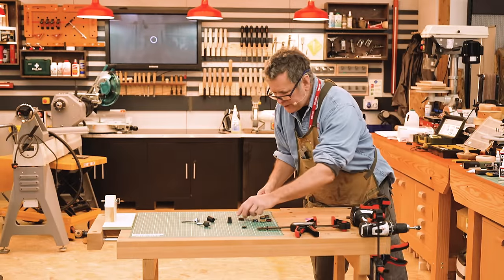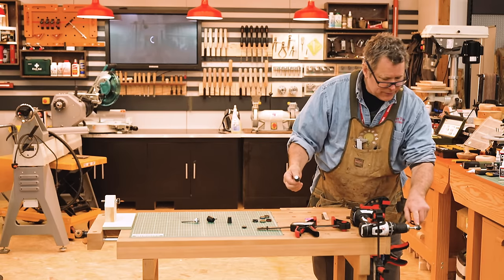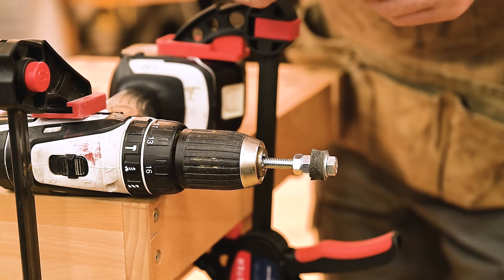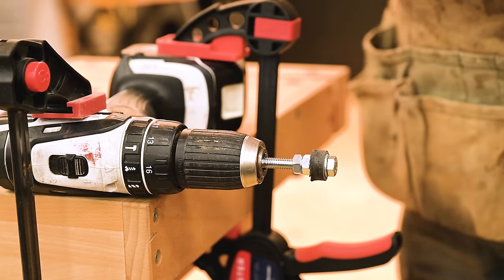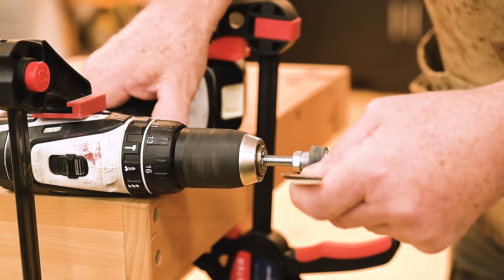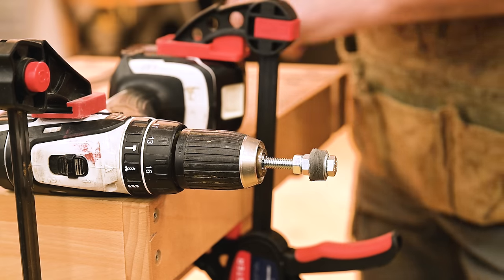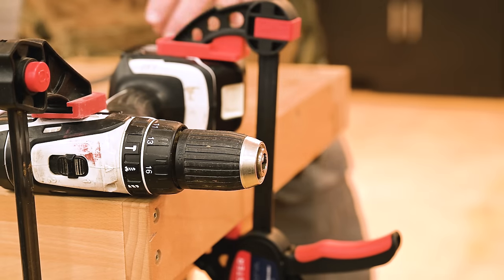So what I simply do is take my starting washer configuration. This one is actually the fender plumbing washers. This is sort of the cork, and I just fit this. This is one that they made up for me, so it's a little too small, which was intentional, I hope. You simply want to sand this, and the rubber sands real easy. I can simply sand this thing down like that, and I just keep pushing this until it fits on here. Now I'm going to cheat and not have you watch me sand as much as I'd like, so I'm just going to come back over here.